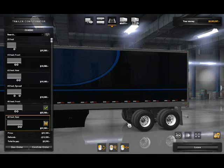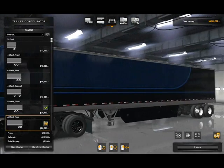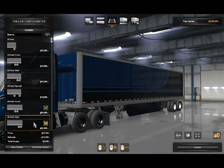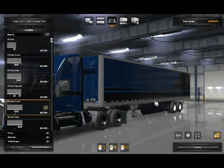And you could tell who has forgotten to do that because these wheels are sitting behind the trailer and the trailer's on the ground. That's exactly how that happened. They forgot to lock this out after they did the shift. Anyways, when you're at the scale and the weight is wrong, you will need to shift the trailer to compensate. Let's say here it's bad because all the weight's in the center, which will cause it to bend in the center. So you come here and this is the closest. And let's say it's not exact, but it's close.